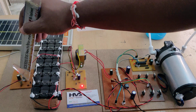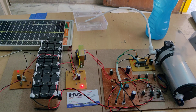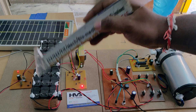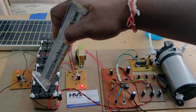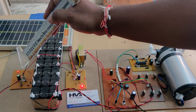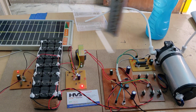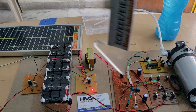These four diodes act as polarity protection — they also function as a rectifier converting AC to DC. Polarity protection means that if the solar panel is connected in reverse polarity, without these four diodes the plus of the solar panel could connect to the minus of the battery, potentially damaging the solar panel or battery. These diodes ensure a constant polarity of plus-to-plus and minus-to-minus, giving a regulated DC output with correct connections.